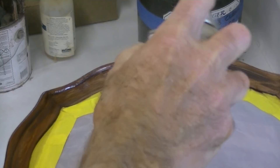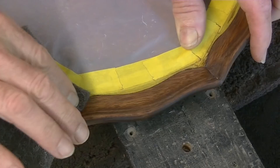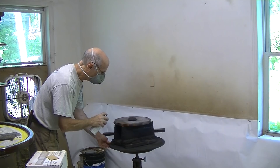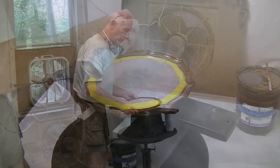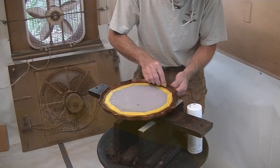Last night off camera I gave this another coat of sealer. Now I need to sand this, although I'm not going to use sandpaper — I'm too worried about cutting through to the bare wood through all these corners, so I'll use a Scotch-Brite pad. Now I'm going to spray a coat of satin lacquer on the bottom and the top, and then I'll decide after it dries whether I need to do any more toning or whether it needs another coat. This has dried really well. It looks really good on the bottom, it feels smooth. But in the molding, especially on the new piece I made, it's just a little bit rough. I'm going to use 500 grit and then the gray pad and do the whole edge and spray it again.